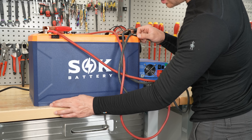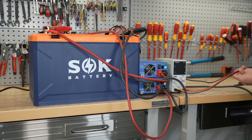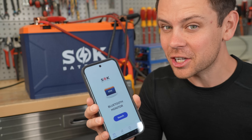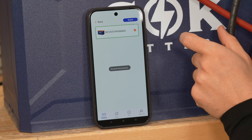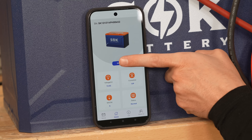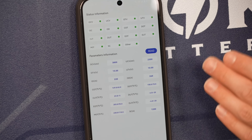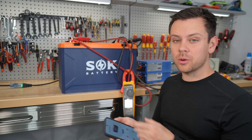The power switch is not taking it out of safety mode enough to charge it up, unfortunately. We need to use a power supply. And now we're charging with 140 amps. Now we're going to test out the Bluetooth app, because I think it's pretty good and a lot of companies could learn from this. First you press search, the battery comes up, you click it, and you get the voltage, the current, the state of charge, and any error codes. If we press enter we get more information, and if you want a lot of information, you press info, press read, and it shows you everything. It works every time and it connects so fast. It's just so nice when something works every time and it's easy. We'll come back when this is fully charged.